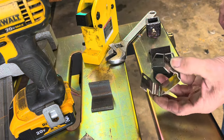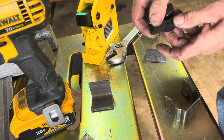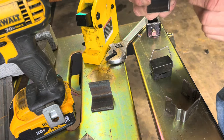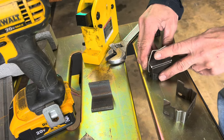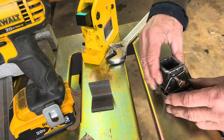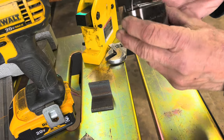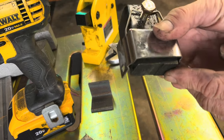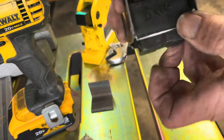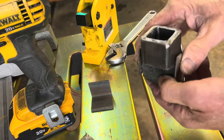I think I've got it figured out. This is the piece I cut in half. Here are the jaws — there's a little spring in here that spreads apart to help lift it up and down. I got a piece of little angle iron, cut it one inch from here to there, same thing on the other side. This fits in tightly here, goes into the jaw, and sits in here like that. Now I just have to weld it all together, with the bottom lifted up a little bit so it can separate and crush — it'll get shorter that way.